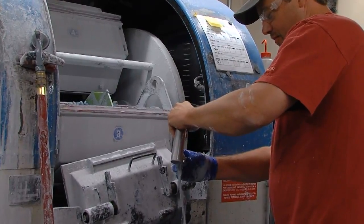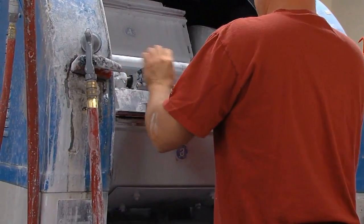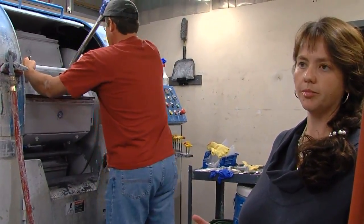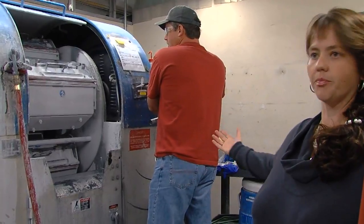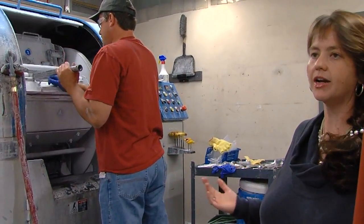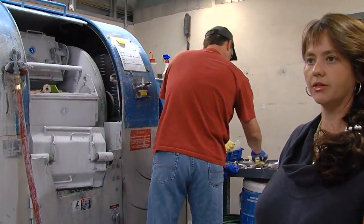I know a lot of machine shops in the industry and I do not know of anybody else that has a centrifugal barrel finishing machine. We have been able to reduce our deburring, improve our polishing processes, and get a consistent product every single time — which is not possible in any other machine shop I've seen, because they're using manual methods. You're always going to have missed spots; Brad may be more heavy-handed than I am, so his parts come out more deburred than mine. It's a very inconsistent process to do by hand.